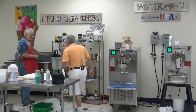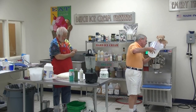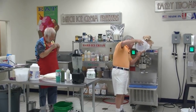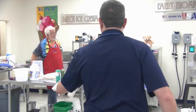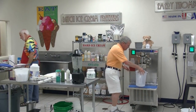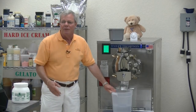I'm going to run a short rinse through this because I did not measure how much Sterisheen I used. If you read and follow the directions properly, you don't have to rinse afterwards, but I just want to make sure there's no residue. We've built a slight pitch into the barrel so that it's going to drain everything out completely. Turn off the infinite overrun control and drain it out. If we don't open this door and put our hands in there, we can make ice cream now for the next 20 hours. If we're going to take an hour break for lunch, I would re-sanitize, but otherwise you can go batch after batch.